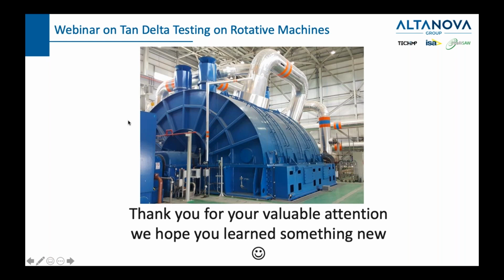When you press start, you should always look at the bottom left corner because it tells you what's happening. The first thing you will see is load evaluation. We are evaluating how much the load is to understand how much power we need to put in the power supply to generate the necessary current. Then we have calibration, then measurement. Then once again calibration and measurement, because we always measure not at the nominal value, but a few hertz above or half a hertz or 1 hertz or 2 hertz above and below the nominal frequency, just to avoid the noise.